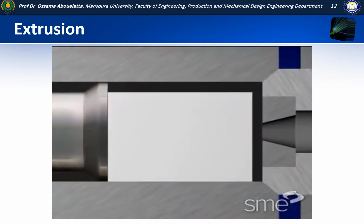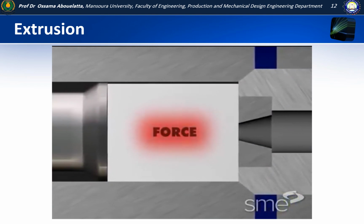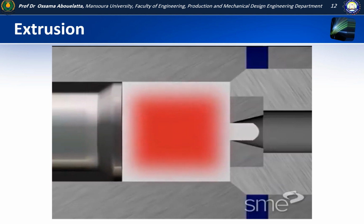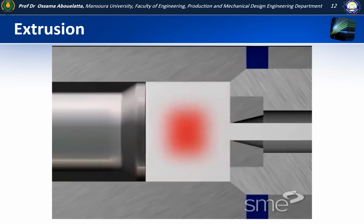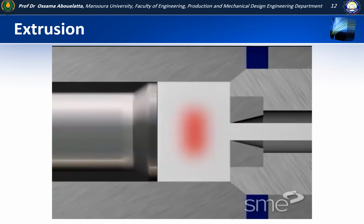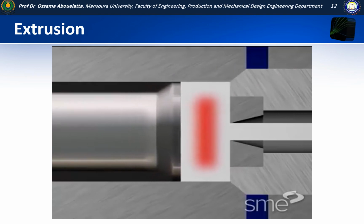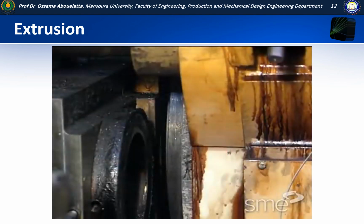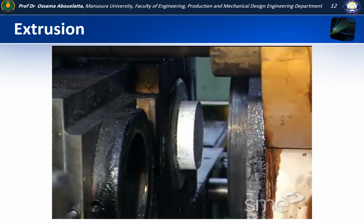Force increases rapidly as the billet is upset to fill the container, then increases further as breakthrough force before extrusion begins. Upon breakthrough, the force declines as billet length decreases until a minimum force is reached. As the billet thins, the force rapidly rises again to continue metal flow radially toward the die opening. Resistance to deformation or force requirements increase markedly as the thickness of the butt or unused billet portion decreases.